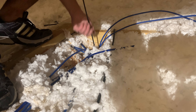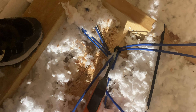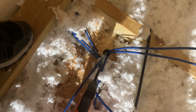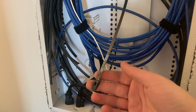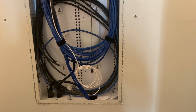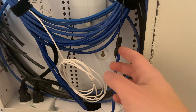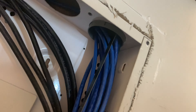The manual calls for using a one-fourth inch drill bit for drilling holes into the drywall. So that's what I've got. I'm just going to double check to make sure that everything is as aligned and as straight as possible before I drill. Point of no return — that's perfect. Now we need an eleven-sixteenth inch bit for our ethernet cable hole. Earlier I think I said one-sixteenth — I actually meant to say eleven-sixteenth for the ethernet cable, so that's what I'm going to drill right now.